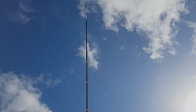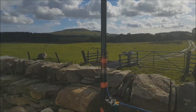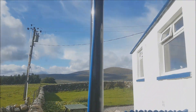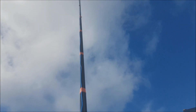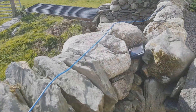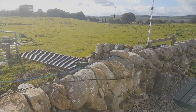So I have the pole for the vertical HF antenna. That is a 6 metre roach pole. I've got the balun on it there. And that is a 5 metre wire attached to the pole to perform a vertical antenna.